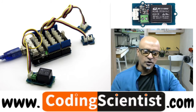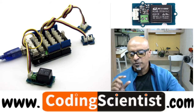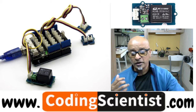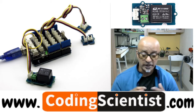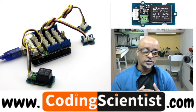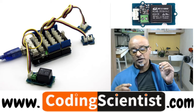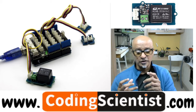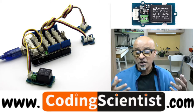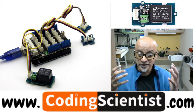We are going to see how a relay sensor works. This is how the relay looks — if you take out your kit, you will find a small black color module which is a relay module. It's basically a digital normally open switch, an NC/NO switch, that works on an electromagnetic mechanism. Through this relay switch you can control a high voltage circuit with low voltage — you can trigger it with just 5 volts, sometimes even 3.3 volts, and control 230 volts or 110 volts of AC current as a switch. Fantastic, isn't it?